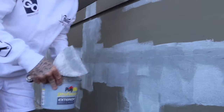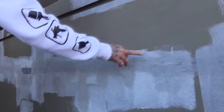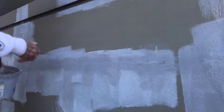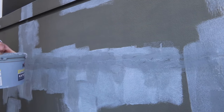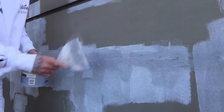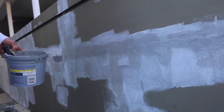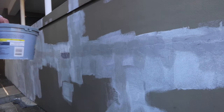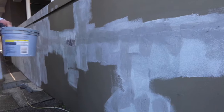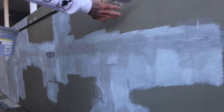That's what we're going to do — go through and do that to the whole wall. Then we'll give it a light sand on any areas, just a real light sand. Or you can go through with your blade and just knock off any little dags. Then we can apply the texture coating over the top. Once all this dries, I'll get out the texture coating and show you exactly the procedure to blend it back into the textured wall.